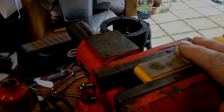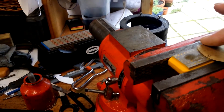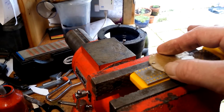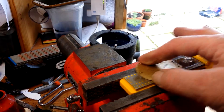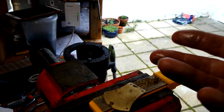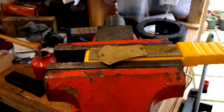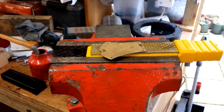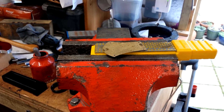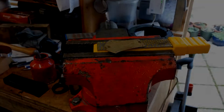I'm trying to keep it as flat as I can when I sand with it. I've also got some oil on the lap to facilitate the process — though the trouble is it makes my hands slippy, so I have to keep wiping them; a little bit of a fiddle, but we'll get there. The main concern is whether it's flat enough. Once it's on the actual standard I'll give it a final lap again, just to take out any curves that may have arisen as part of this process.